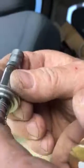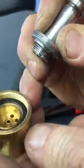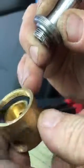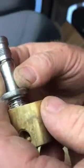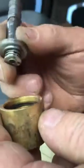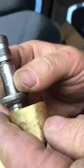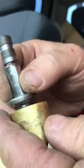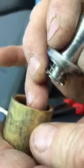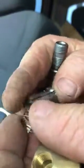When the solenoid is magnetized, this plunger goes up, closing off fresh water, and then letting the back pressure from 2 on the valve exhaust through 1. Essentially, when the coil is energized, this just pushes up and lets water flow through down here, okay? So if you pull the tubing off for your end gun and it turns on, but the next time your end gun is supposed to shut off, it shuts off and then it won't turn back on, this is plugged, okay? Or this plunger is not releasing, okay?